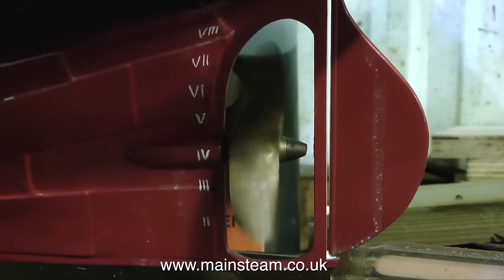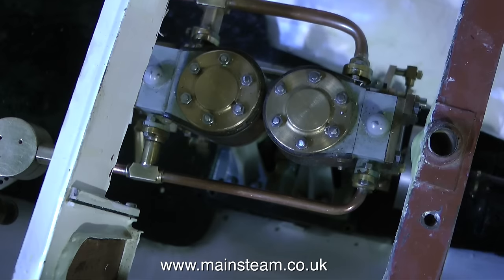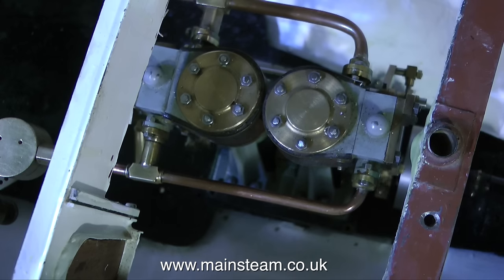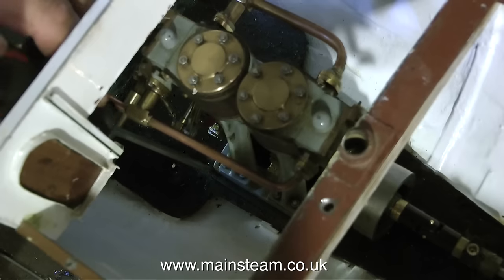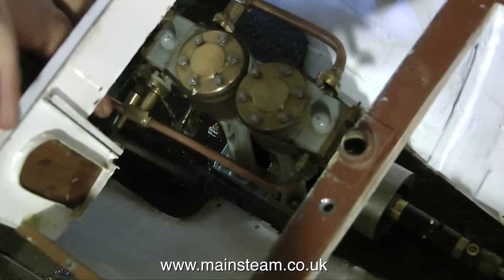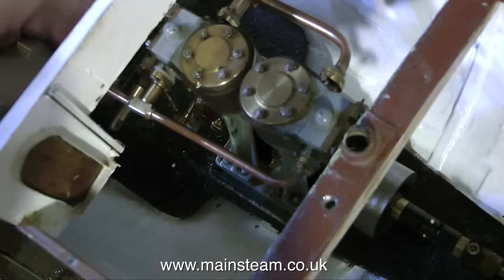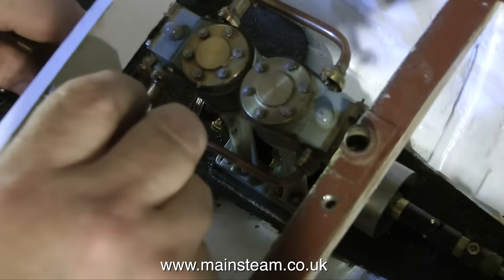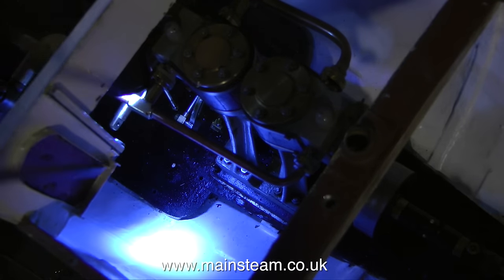I place the engine into the boat and connect the prop shaft, and the propeller goes round. At this point the engine is not bolted in, it's just sat in there — so this is a good sign, because the engine is not leaping all over the place. The engine's actually found its own position, and unfortunately that position does not align with the bolts through into the bed plate, so I'm going to have to modify this. This has nothing to do with the original builder; it's a different engine and it's just not lining up quite correctly. The engine went in and out of the boat many times, and each time I modified its position on the bed plate, until I finally put it in for the last time, bolted it in place, and it was perfectly aligned with the prop shaft and sounded very sweet.